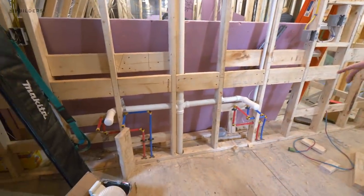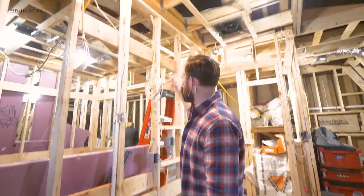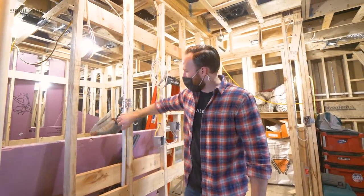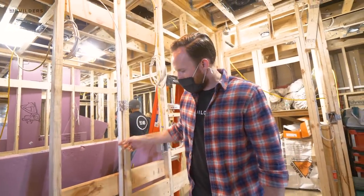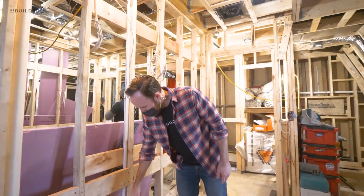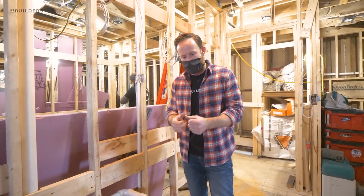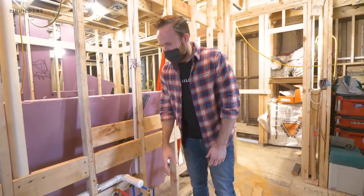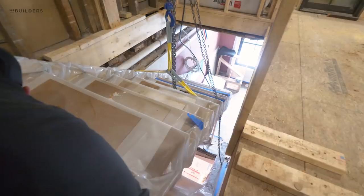You can also see the vanities all prepped for plumbing. This is the condensate line — we needed a condensate drain from the air handler in the attic. Originally this was going to run to the sink in the coffee bar of the bedroom, but I was worried about hearing a gurgling noise in the middle of the night. So we ran a slightly longer run to get it down into the bathroom. We'll put a trap on it with a dishwasher tee — similar to under a kitchen sink — so all condensate makes its way into the trap.